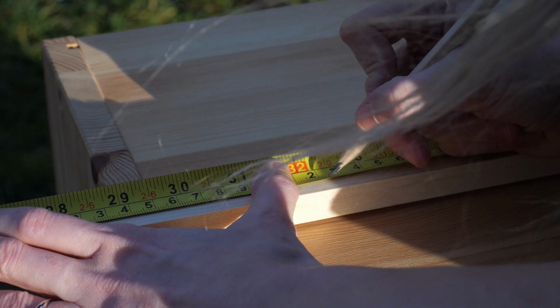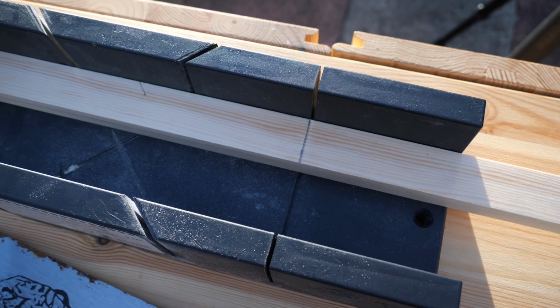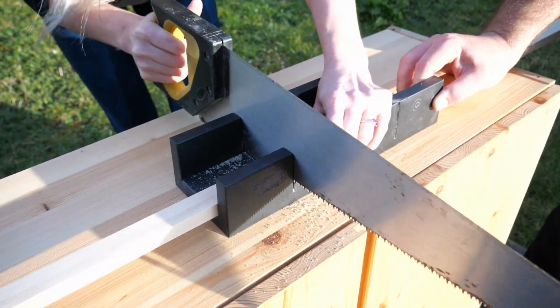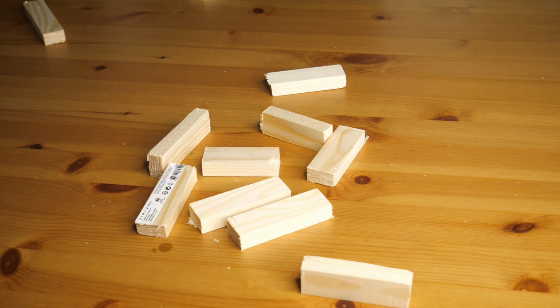It's not cheap. So anyway, the day I started this project was, I'm pretty sure, the only sunny day that we have had so far this year. So I immediately got started with cutting my wood pieces because I wanted to be able to do this outside to save my dining room from the sawdust hell. And these pieces were really easy to cut down. I just marked how long I wanted the pieces. I used a mitre box to make sure that all of my cuts were going to be straight and square. I just lined it up and cut away. This did take a little bit longer than I had anticipated, but wasn't too bad overall. And I also cut a whole bunch of these little wood pieces to use as spacers.